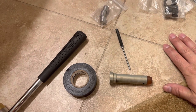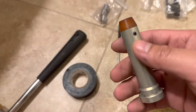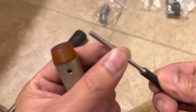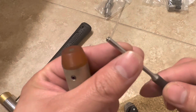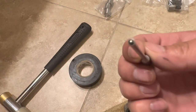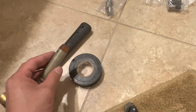That's why I recommend you customize your buffer. Let me show you how to disassemble. All you do is remove a roll pin — just drive this roll pin out. It appears I'm using a 1/8 inch roll pin. Be sure you use an actual roll pin punch. Notice how it has a little tip at the end — this helps it from deforming. Because if you use just a regular punch, you can easily deform it, have it crush in. So just use a roll pin punch. I bought this whole set for about 10 bucks. Be sure to use the right tools.